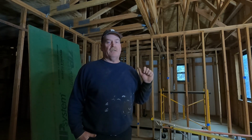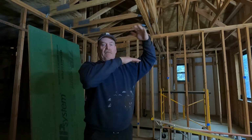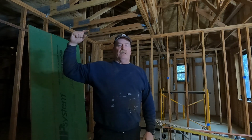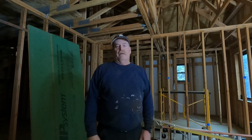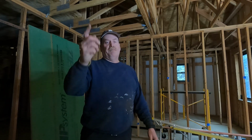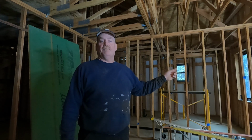For whatever reason, they always called us in last, and anytime I needed to run a duct through, like under a floor, like between first and second floor, and I needed to run a duct through a corridor, it never fails. The electrician runs their wire right through the floor joists, between the floors, and I couldn't get a duct through there, or they'd have to come back out and move it. So anyway, pro tip there. So let's get started on the plumbing vents.